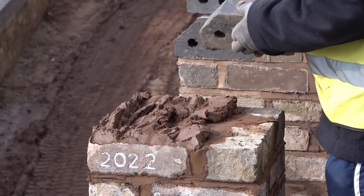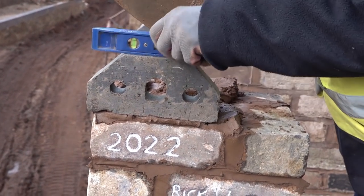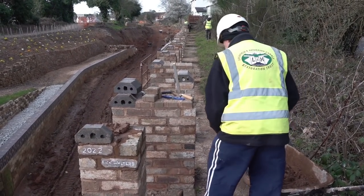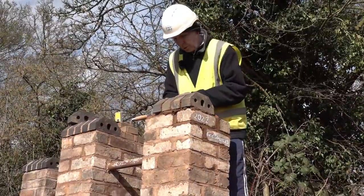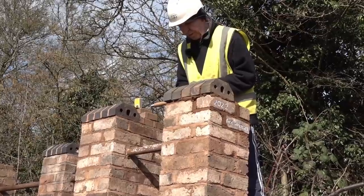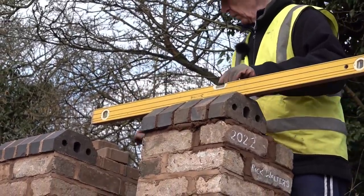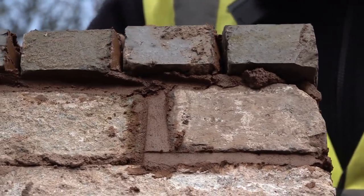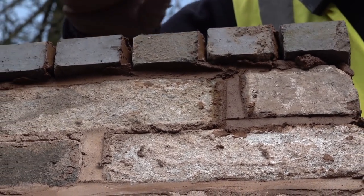You can see I've got to have it like a lip drip for the rainwater to run off. I've had to adjust the joints to make them tight so that the five bricks fit onto this pier. So as you can see I've got a nice little drip — when the water hits that it'll just run down. Unfortunately I can't do it on the other side because it's not practical.